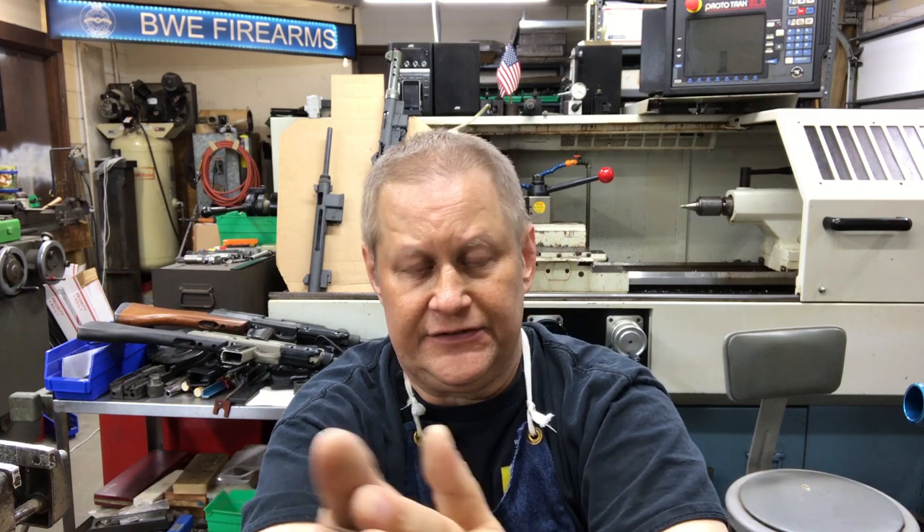The easiest way is ammunition. The hotter your ammunition, the faster you're going to run. With open bolt sub guns, you need to be careful, because if you get too light on the load, the bolt will not kick back far enough to catch the sear and you'll get run-ons. All open bolt sub guns and open bolt machine guns are like that — the belt fed guns, the Colt light machine gun will do the same thing if the ammo isn't hot enough.